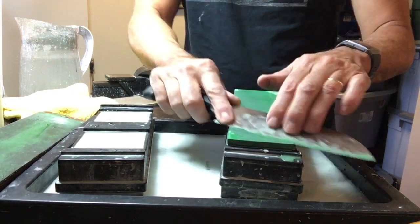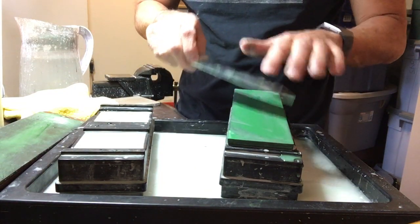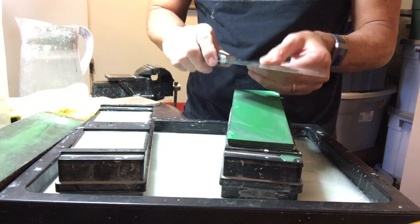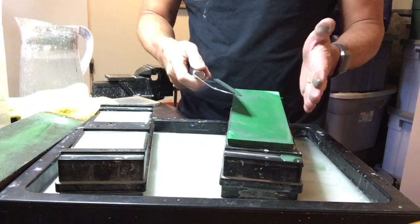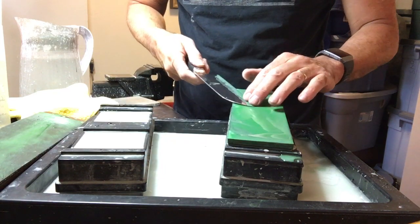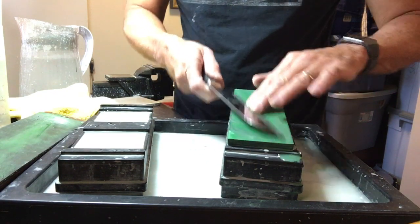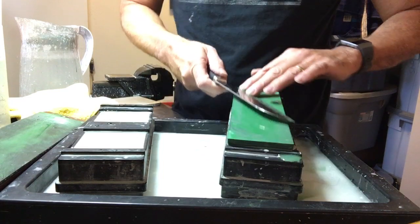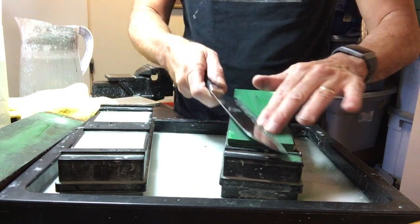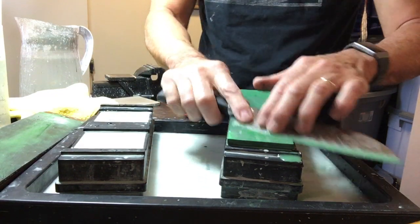So now I'm going to form another burr on the other side. So now I have a burr, yes, a very small, subtle burr, which is what you want, on the other side. Now I know that I've reached the edge of the edge. Now again, I go back to the burr removal process, the deburring process. So again, same thing, but at least 50% reduction in pressure. I'm cleaning the edge. That's the most important part of sharpening. Clean this edge.